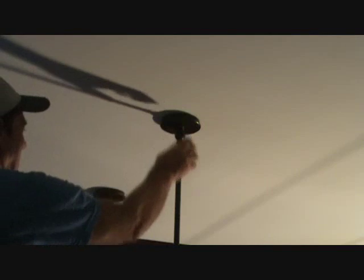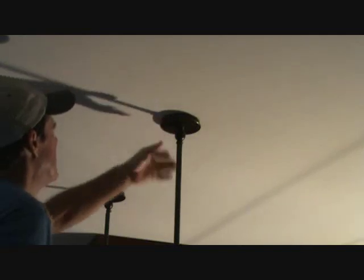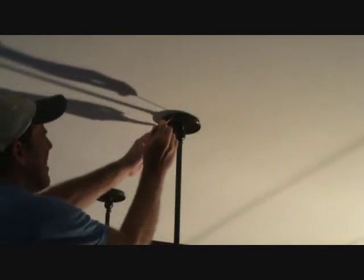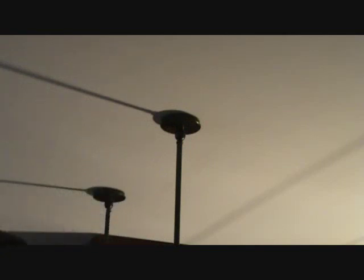I'm not going to show you how to remove all these light fixtures — I think you can figure that out on your own. But every light fixture goes together a different way, so you just have to look around. On this particular one there are three screws up in here, so I'm going to undo that and this whole thing is going to pop down so I can get to the wire nuts. Just take your time — it's really pretty easy to do yourself. Take that out, pull the wires down, undo the wires, and remember how it goes back together. Usually it's white to white, black to black, and ground to ground — that's on most standard fixtures. When I pull this out, I'll show you.